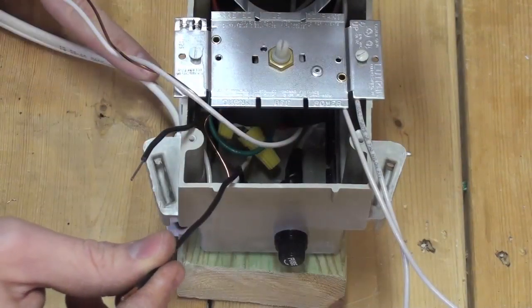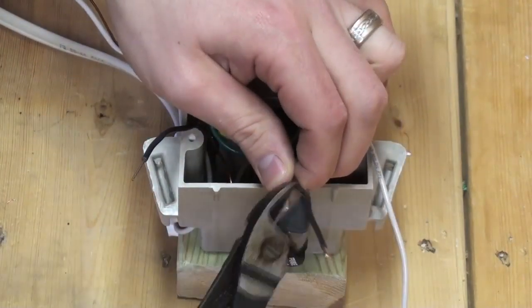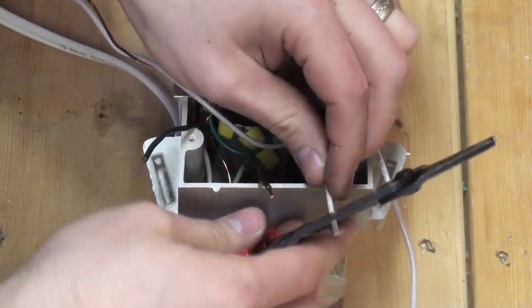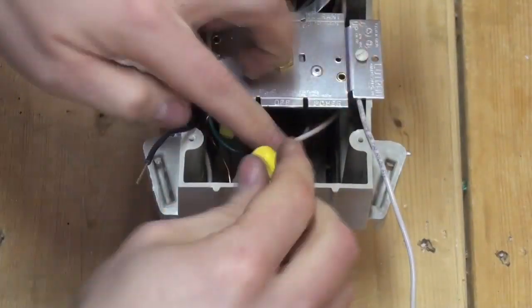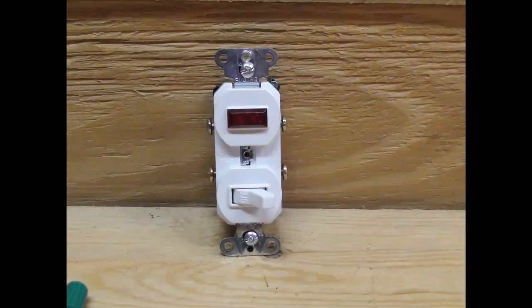Next, the positive leads from the fuse holder will need to be spliced into the circuit. Take the positive lead from the 14-2 service wire and attach to one lead from the fuse holder. Once stripped and bound, bury the cables under the dimmer switch. The circuit is now ready for the 15 amp toggle switch with pilot light.